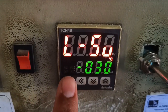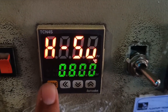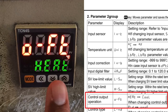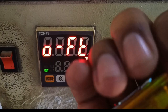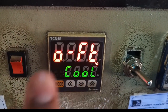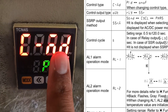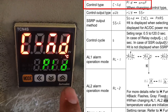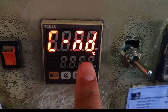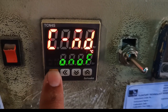Next is the lower limit of temperature, which we set to minus 30°C, and the higher limit, which we set to 800°C — these are just the operating range limits for this controller. The next parameter is control output operation: set to heat if using the controller for heating, or cool for cooling. We set it to heat. The next parameter is control type: if you select PID mode, you enter the PID derivative values; if you select on-off mode, the controller will automatically switch on and off according to temperature. For better operation, set PID mode.